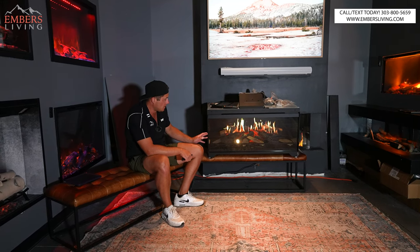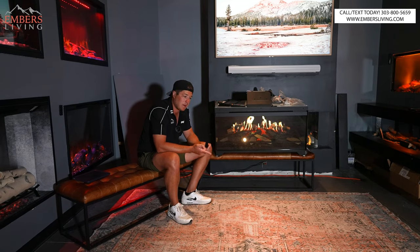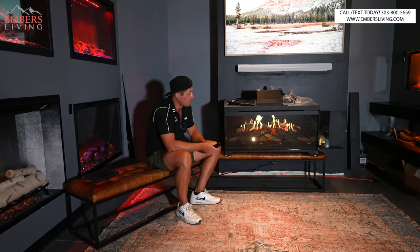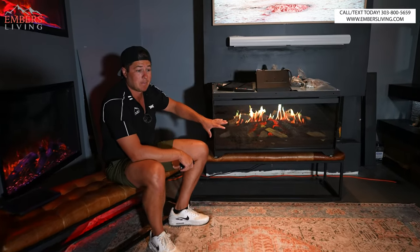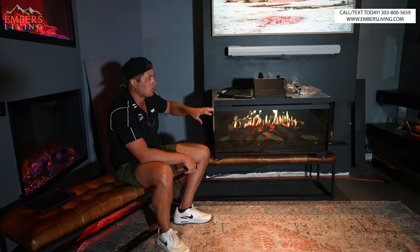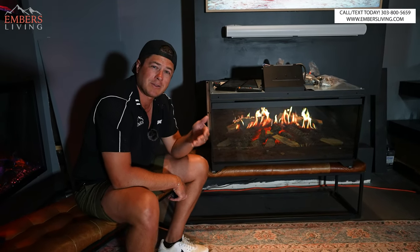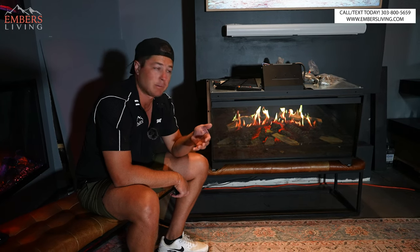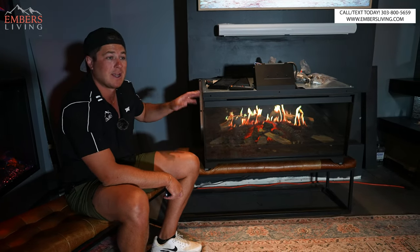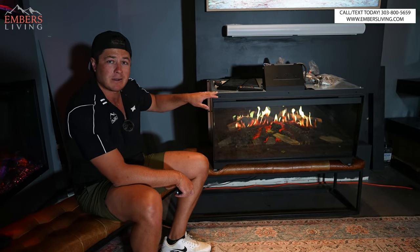There is a way to change the flame speed, and this also has app controls. I love that it has a two-dimensional flame — it just makes it look really, really nice. The reason it's not number one is that it's extremely pricey — by far the most expensive electric fireplace for the size. Also, a lot of traditional clients want 220 heat, and this only has a 110-volt option. I think this is more of a hybrid unit, more in the modern-type feel.